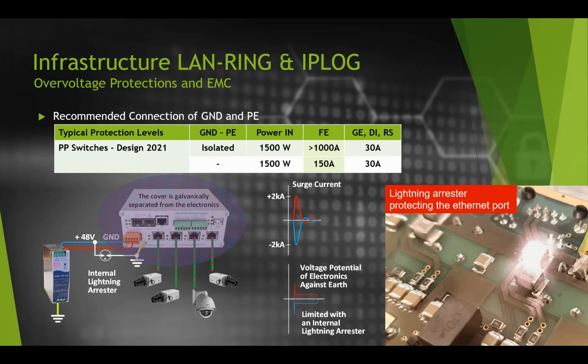Every properly designed Ethernet port is designed to be galvanically isolated. The data is separated by a transformer with a strength of typically 1500 volts, and the PoE part by a switched-mode power supply with galvanic isolation. As you can see on the slide, when a surge occurs, only the lightning arrestor is ignited in a controlled manner. The energy is safely conducted to Earth without destruction.